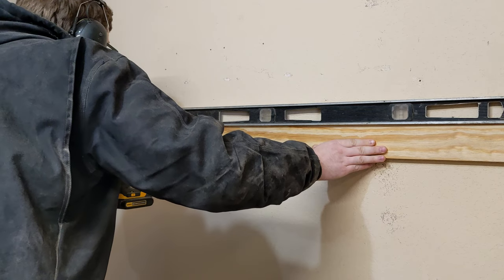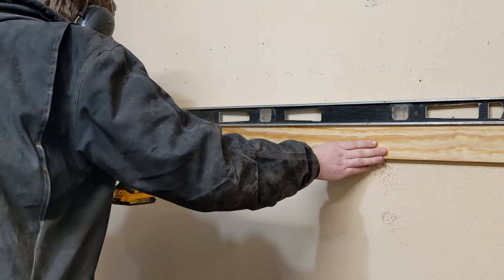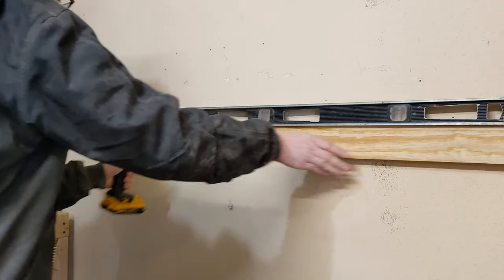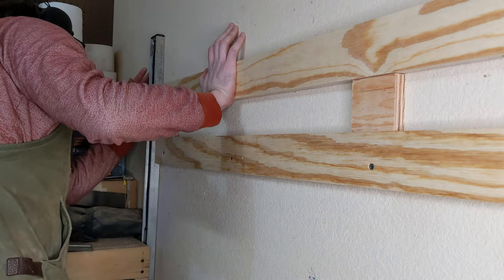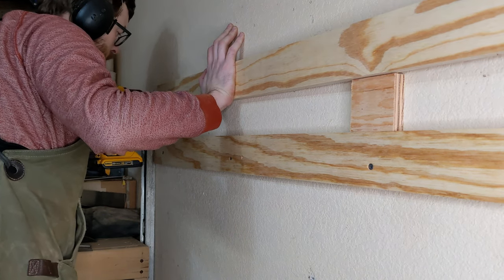After removing the previous furnishing adorning this wall, all of this open space was ripe for filling with quality storage solutions. I used a small set of spacers ripped to the same dimensions to place all of the cleats, and then I doubled up those spacers to avoid an outlet lower on the wall.